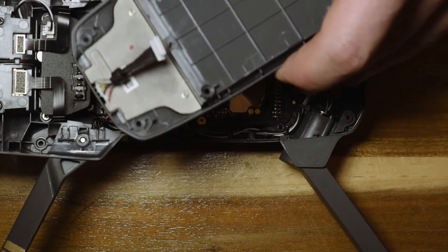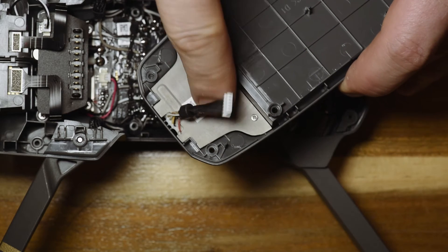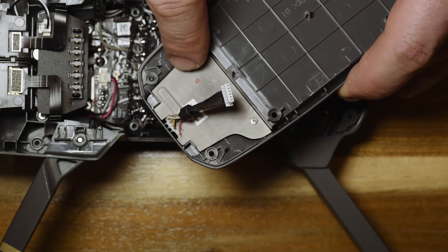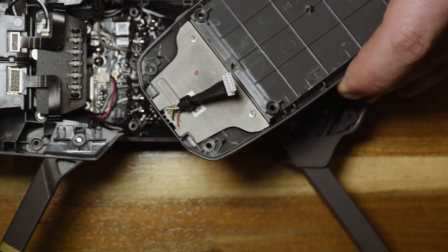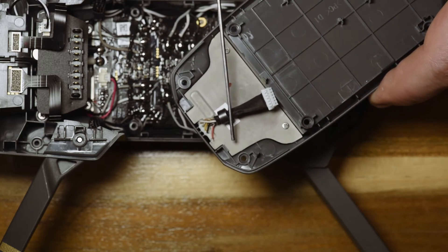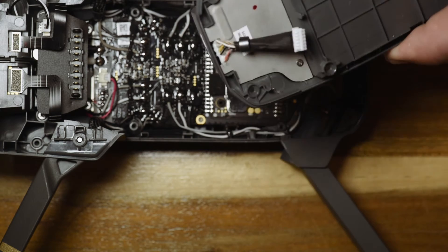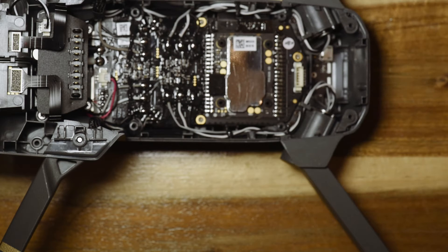So this you can see is nicely shielded. The GPS and compass are underneath here, and there's a ferrite bead there for some more shielding — all very nicely done, very DJI fashion, high quality manufacturing and attention to detail. There's a metal shield and the GPS unit is underneath this back bump of the Mavic.